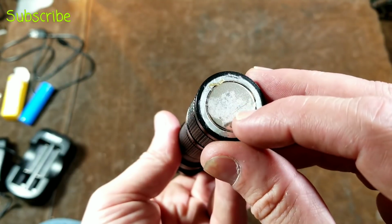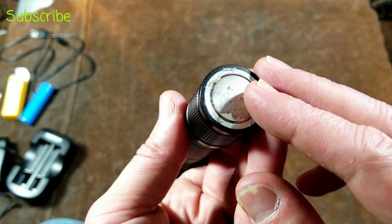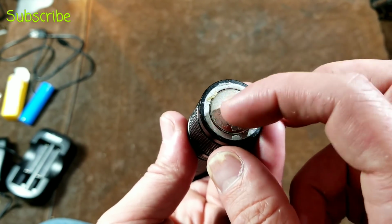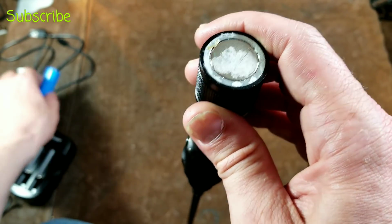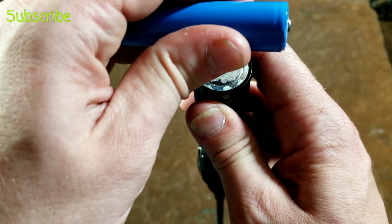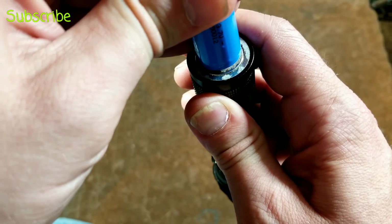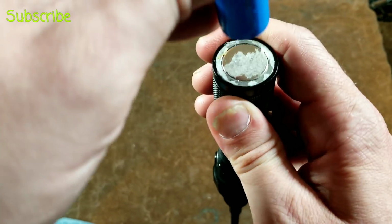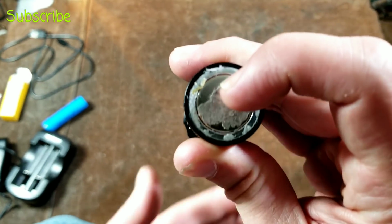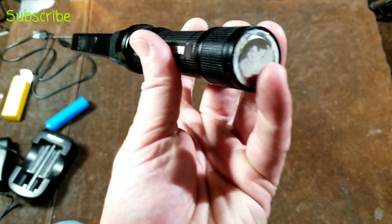It actually has a pretty thick and strong neodymium magnet. This is a rare earth magnet and it holds on pretty strong. You have to remember about these magnets that sometimes you say, well, it's not holding on as strongly as I expected. Well, if you're on a round surface, it will hold, but it won't be super strong. If you have it against a wider, flatter surface, then there's more area for the magnet to interact with, and it will hold on stronger. Obviously, a thicker cross-section of metal, thicker steel, will hold stronger than thinner steel.